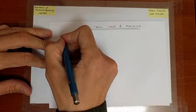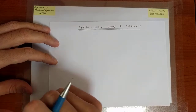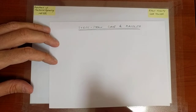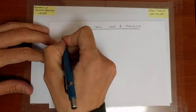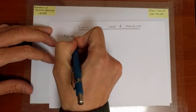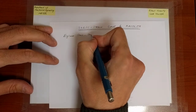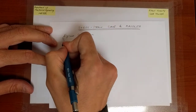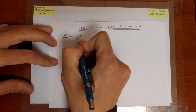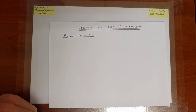All right, so essentially, what we would like to do is understand how materials fail. An ultimate test for that is to take a piece of that material and just break it apart, right? And that information will eventually deliver us the stress strain curve. And here I will presently write the engineering stress strain curve, because it turns out that there is another type of stress strain curve that we will eventually talk about.